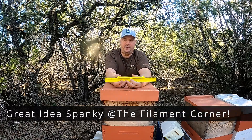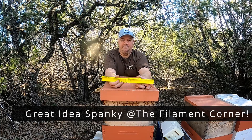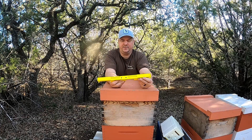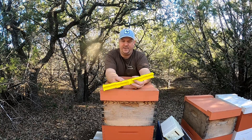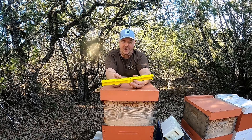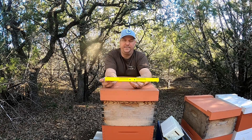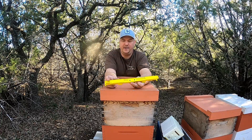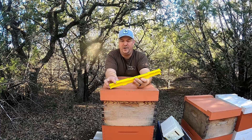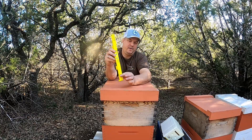I ended up not using the magnets — it was a great idea, but I didn't use them because if I can tweak the model and not have to add anything else, that's my preference. I tightened up the tolerance on the dovetails just a little bit and added a few bumps throughout to give it a little bit of resistance. I think it's great — it doesn't budge. Same on this side.